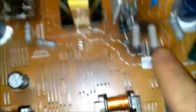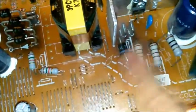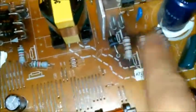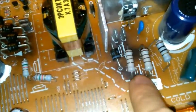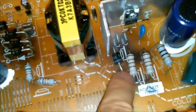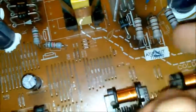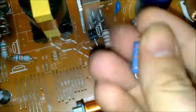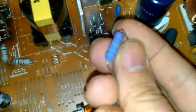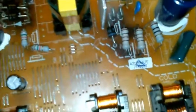These resistors are testing in the high mega-ohm range - they're gone, they're toast. The TV does work, but when they start heating up the values creep up so high that it shuts down. You can tell they get hot. I'm going to put in the 21ks for now. I'm going to order the correct ones later - I'm going to order a higher wattage - but let's see if this works first, and if it does I'll order the proper ones.